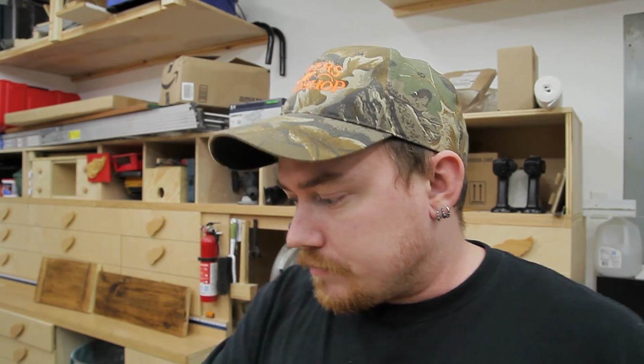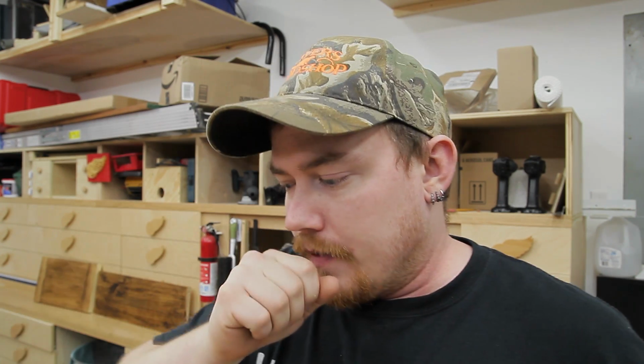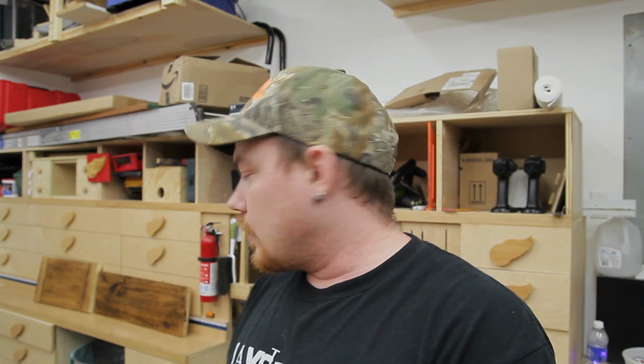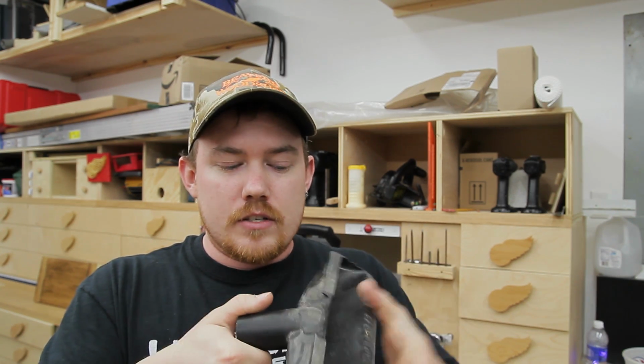And then also this particular jig base, I guess you could say, it's more of a base than it is really a jig. This router base, I want to make probably like a wider flat plywood runner with a kind of like a circle cutout, half circle cutout, that way I can hug the router bit for like edge trimming, and then possibly use a hot glue gun to glue one of these shop vac attachments right to that particular edge guide, and then you can just hook a shop vac up to it, and then you have dust collection right at the edge guide. I've already done that.